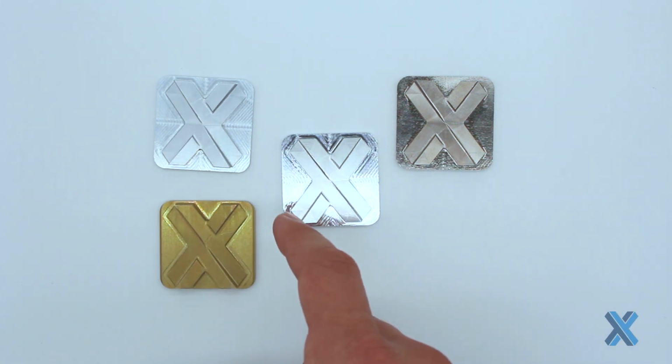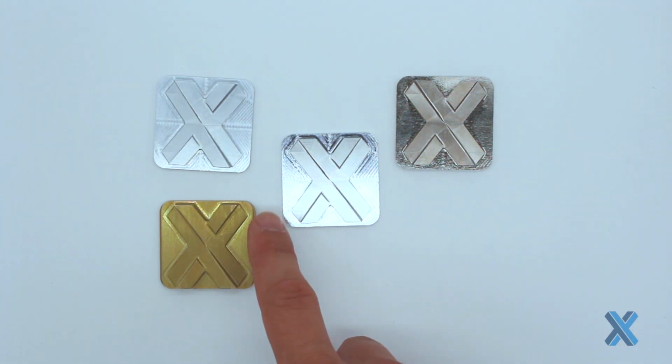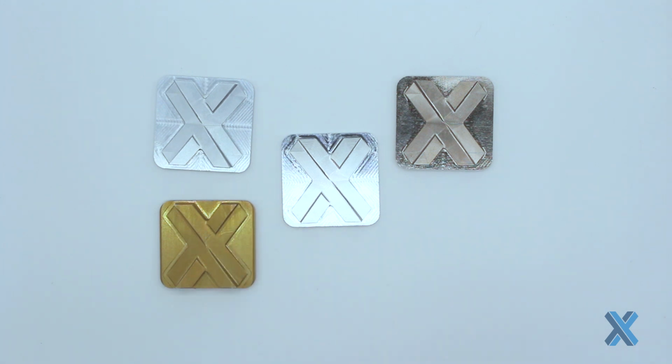So if I'm using this as a ground plane or I'm using this in electromechanical applications, I'm probably going to prep my surface with this first. Now that being said, if I'm looking for corrosion resistance over time, but my part's going to take a beating and I'm okay with electrical conductivity to my part, I may be looking at a metal plate.